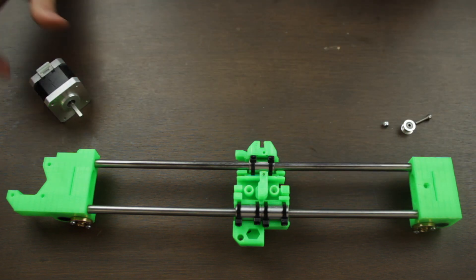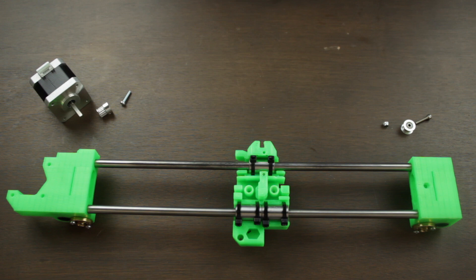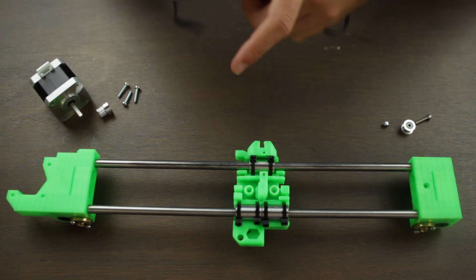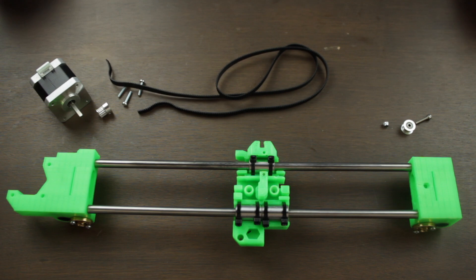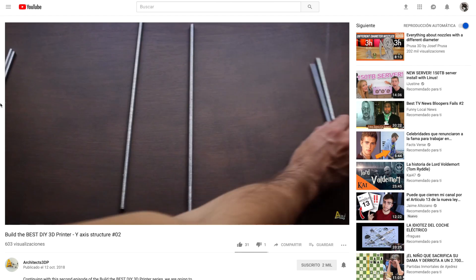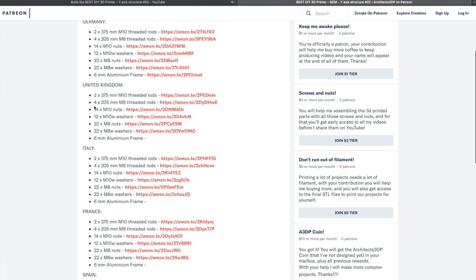For the motor installation, we'll need the motor itself, that is a NEMA 17, the GT2 16 pulley, and three 18mm M3 screws. Finally, the GT2 belt itself. For this episode of the series, we'll not use any 3D printed component, so links down in the description you will find the links to buy all the necessary components from our affiliate links on Amazon.